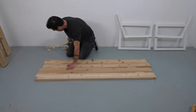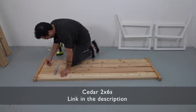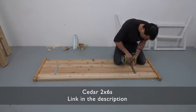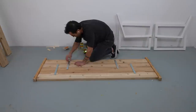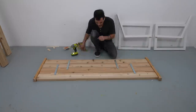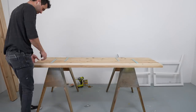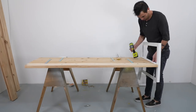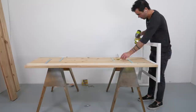For the base, I'm using four cedar 2x6s. Cedar is a softwood that holds up really well outdoors, and I'll put a link to my cedar supplier in the description below. I cut the pieces to length and then used mending plates to attach the 2x6s to each other with quarter-inch gaps in between so water can flow through. I now have a one and a half inch thick cedar panel that I place upside down on sawhorses, and then I place the steel sides and screwed them to the cedar.